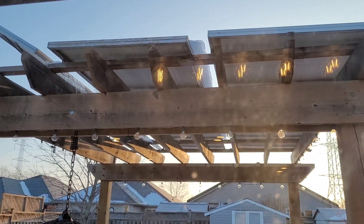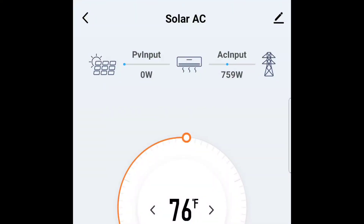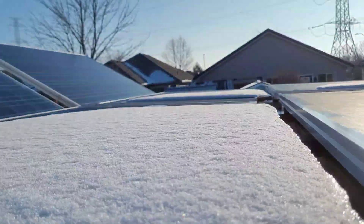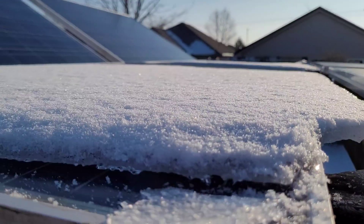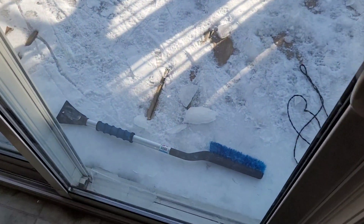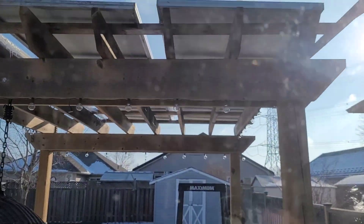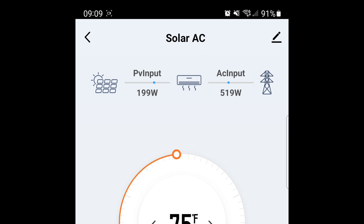The sun is just coming up, not quite high enough to hit the panels yet, and I have a bunch of snow and ice on top of them. So I'm going to go out and knock that off to get some sun. This is the unit running at about quarter to eight in the morning — no solar input, running all on AC power and using about 760 watts. I got the solar panels knocked off and now the green icon is lit up, meaning we're receiving some solar input. I had to break out the old snow scraper — it was pretty frozen up. We're getting about 200 watts of solar input and about 520 watts of AC input, and it's just after 9 a.m. Another hour and we should be on full sun.